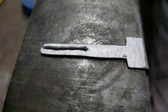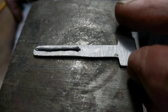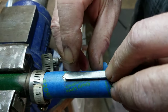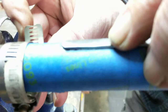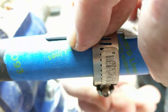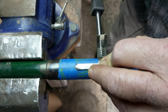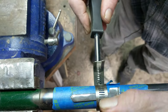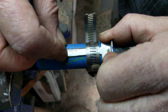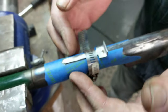Now the next step is you've got to get the work on the gun, get it centered up, and then clamped. We're going to take our silver solder applied rear sight and stick it in the slot where the sight is going to be mounted. We'll hold that by hand until we get our clamp in place, then slide the clamp down here because the bulk of the solder is going to flow up this way. Then we'll take a driver and settle this rear sight base down. You don't have to clamp it too tight — you just don't want it moving when you put the heat to it. Then line it up — that's lined up inside the lines and held securely in place.